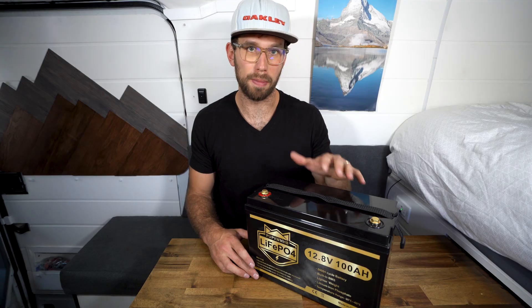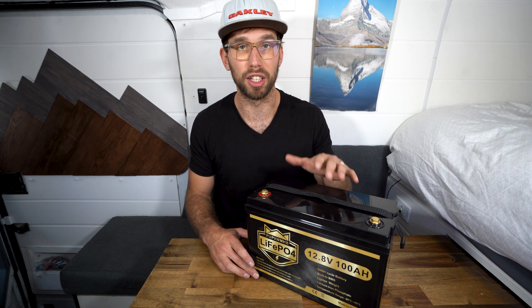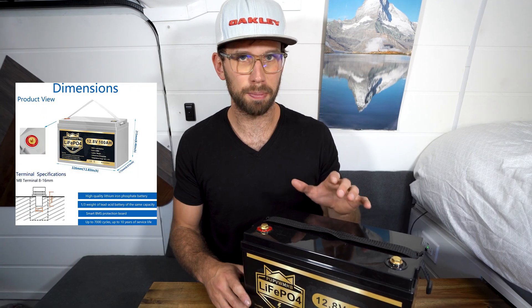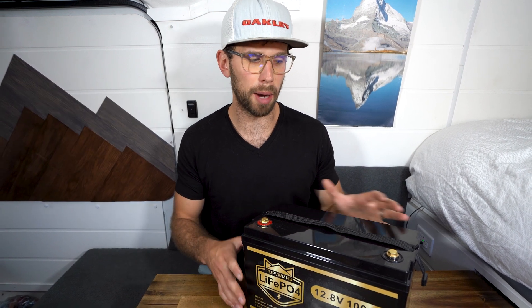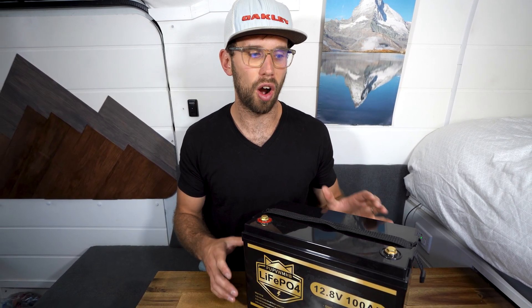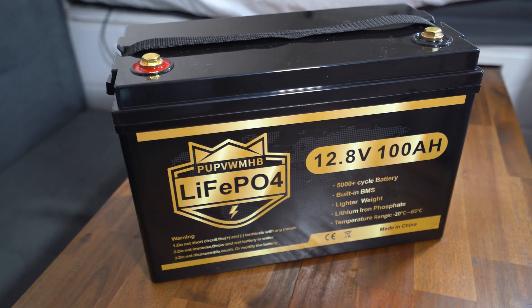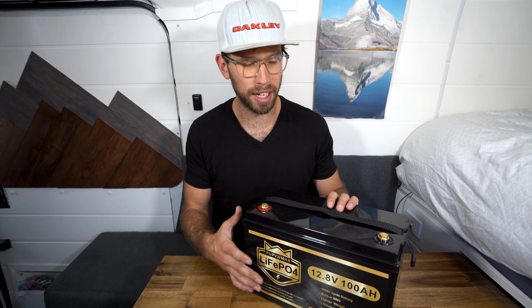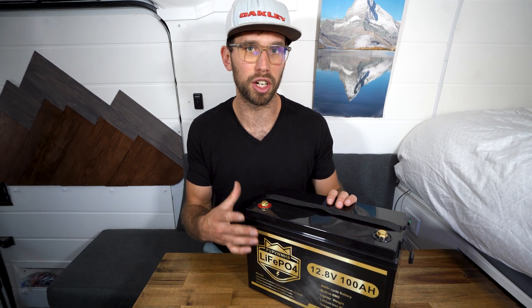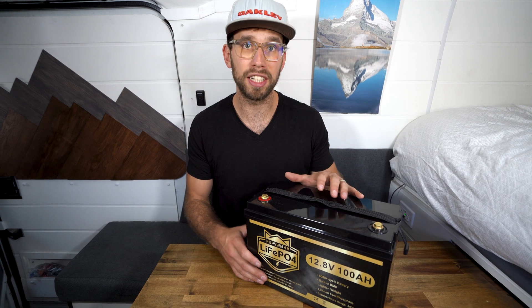This battery has a smart BMS system inside, like most other batteries. One of the features that I really like is the low temperature cutoff. The temperature that this battery is meant to cut off at is minus 10 degrees Celsius, which is kind of low, but I'm assuming that the cells inside are low temperature cells. Most lithium cells can be damaged if you try to charge the battery below zero degrees Celsius, but since this one is minus 10, I'm assuming that they're using a higher quality grade cell. I know that these cells out of China are automotive grade, which is one of the higher grade cells that China produces.